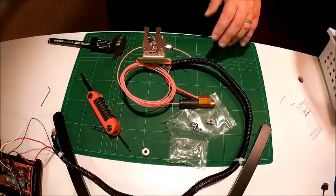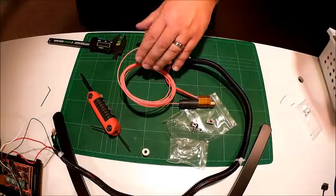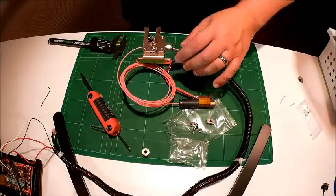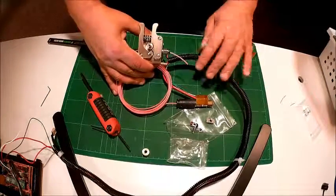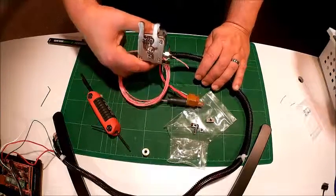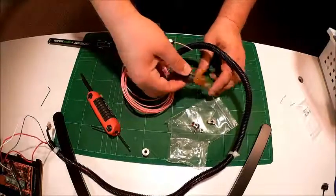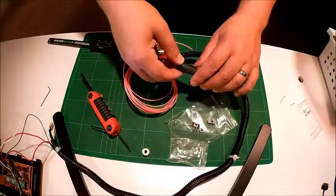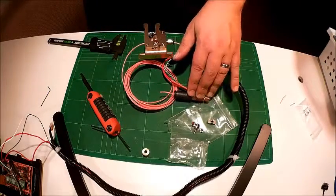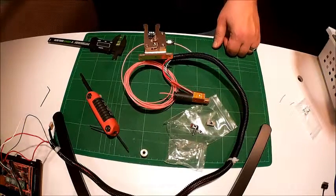I hope this video helped explain how to put together an extruder, how it works, and start you on the way of converting your 2-up to a Bowden extruder. I really expect better things going this route because it won't have the motor and big wad of cabling dragging back and forth — the motor and extruder are heavy. Couple that with the hot end, which is actually very light and only has a few wires attached. I'm hoping this gives us far better prints. If this helped, please like it below and subscribe to the channel. Cheers.